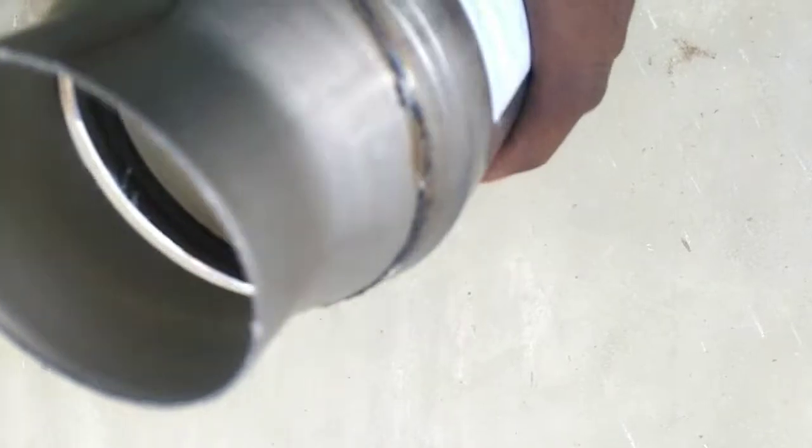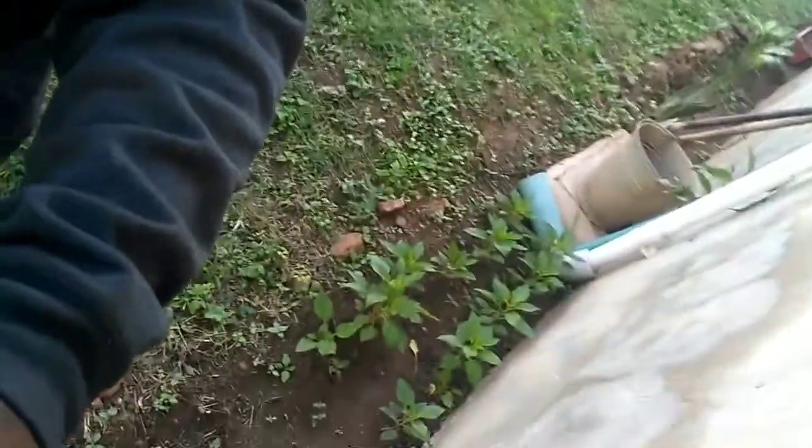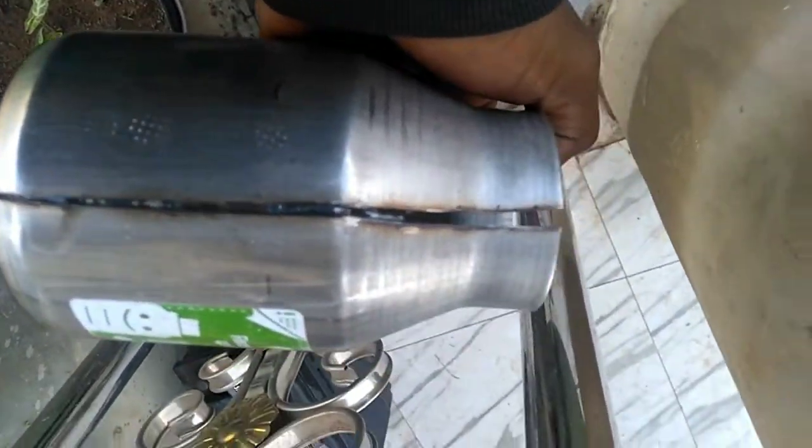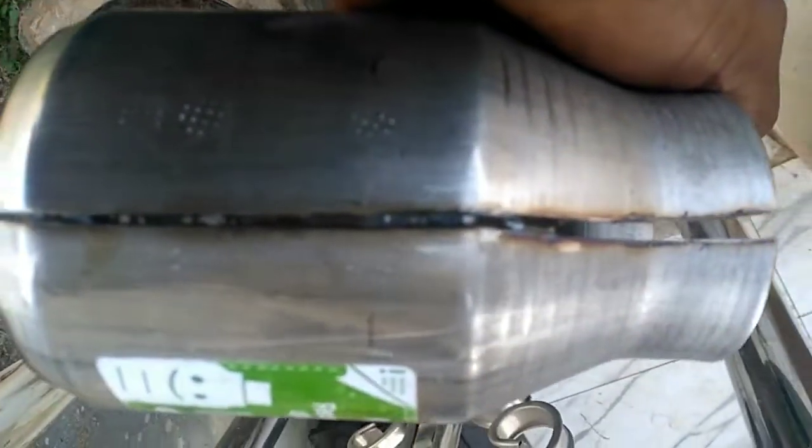This is the first cut — ensure that you don't cut through the substrate material. Next I'm going to split it longitudinally. I've made my cut longitudinally, so next, using a screwdriver, I'm going to pry up on the casing.